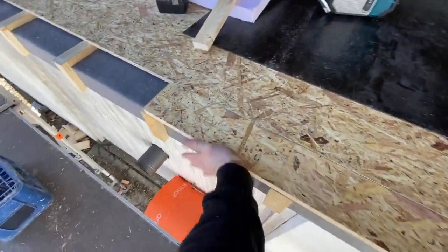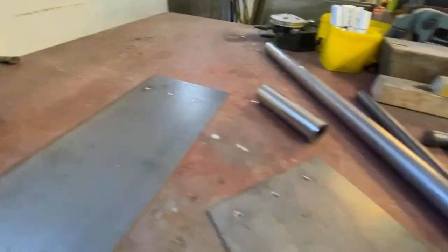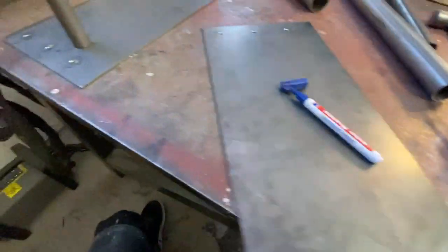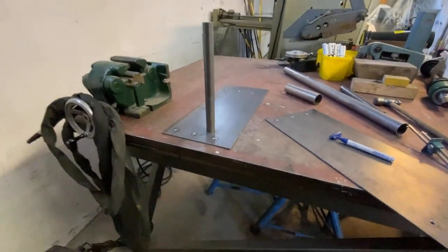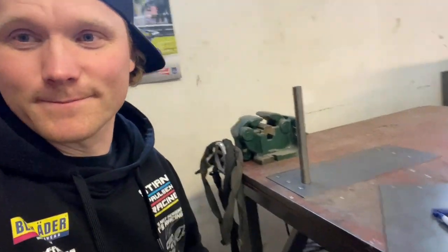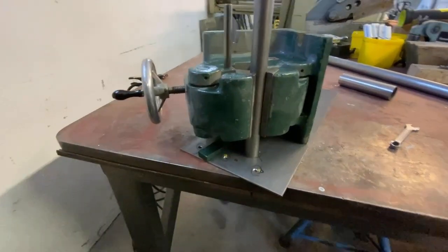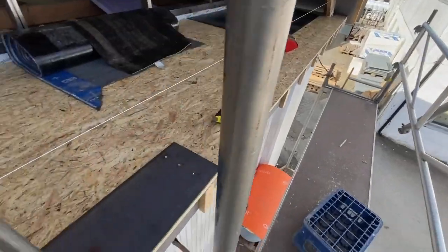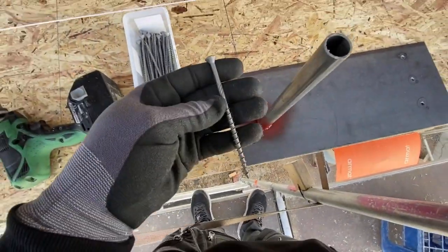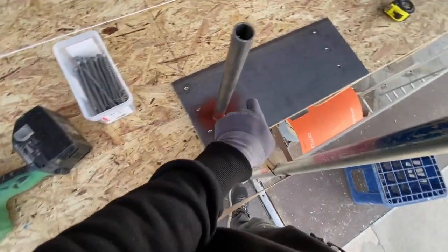Time to finish what I didn't manage yesterday because of the weather. These plates are made — my brother made holes for me. I'm going to weld this one on there as a support for the railing. I found out that Geländer is 'railing' in English. Using a jig so I don't have to hold it — I know it's at 90 degrees. One is ready, second one is done. It's now lined up. Six bolts on each plate, plus glue underneath — it will never move.